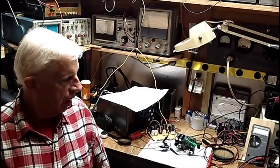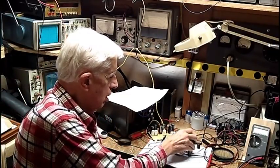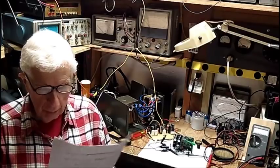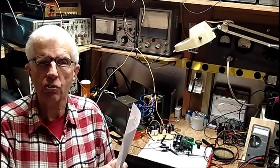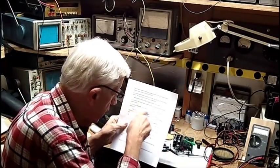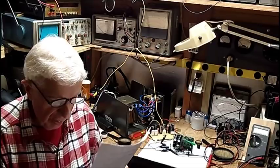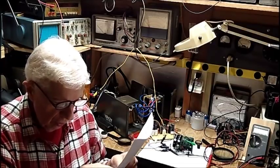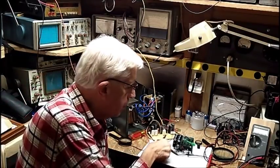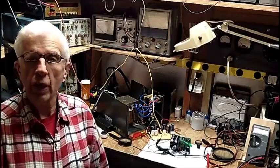Leave it to me. I had my negative meter lead on the negative post of the board. According to this, it's plainly written. I was having difficulty reading this because I was holding the camera, and even though I had my reading glasses on, I was still having trouble. You're supposed to take the negative lead and connect it to the power supply negative — it's plainly written here — which is where it's connected now, and I'm getting the correct readings.